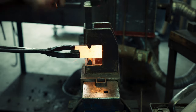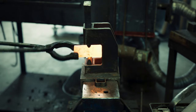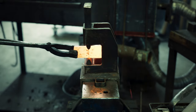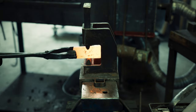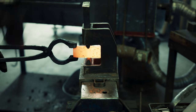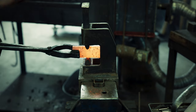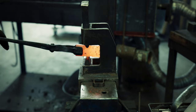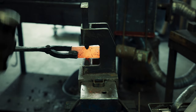The steel, even when hot, is a little bit tough to work and I have to hit it hard with a hammer multiple times. One challenge here is that after each hit, my work piece jumps a little bit and I need to reposition the dice. After many hard strikes with the hammer, I have enough material isolated to do the rest of the work on the power hammer.